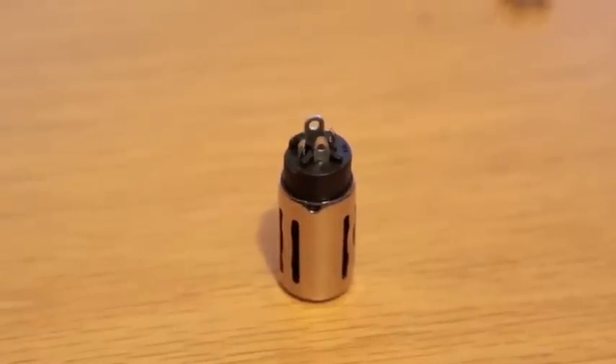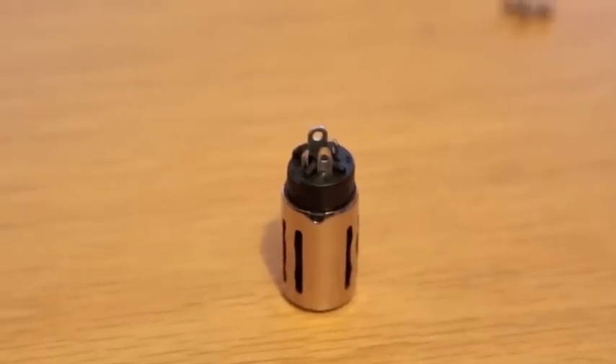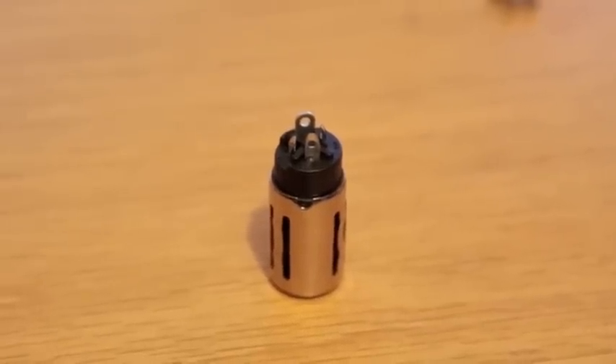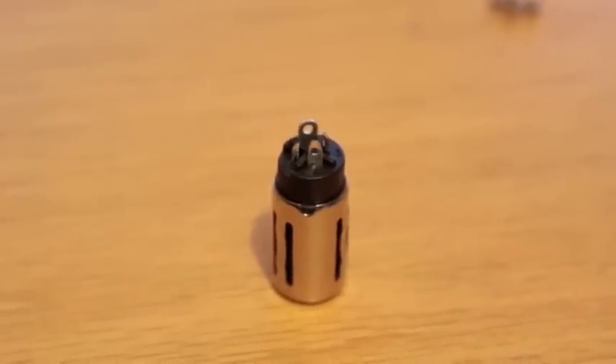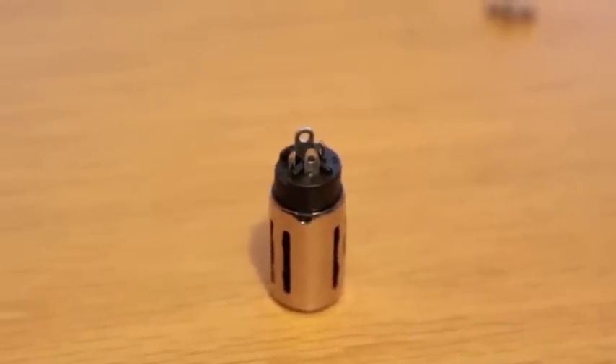You can see we have four terminals on the XLR plug. Terminal one goes to your ground, your shield — it also connects to the top one, which is linked through to the outside case if it's a metal plug. Terminal two goes to the positive, which would be the white or red wire. And terminal three goes to your black, which is your negative.